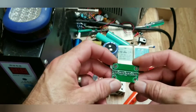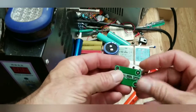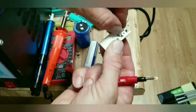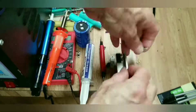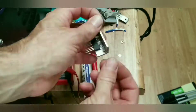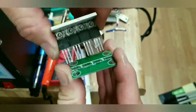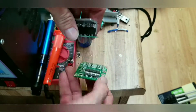The first thing I did was pull out the boards and inspect them — they look pretty good. Next I need to provisionally see if it's even the right size, and the holes seem to kind of line up with the holes pre-drilled in my heat sink. I take a little heat sink grease and give it a squirt on the back of the MOSFET and start bolting the MOSFET in place. It always seems no matter how little heat sink grease you put on, you're going to put too much and it's going to squeeze out and make a mess. We got everything bolted in and it seems to fit. Checking to see where it's going to go on the BMS — that looks like it's going to work out.